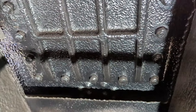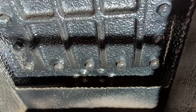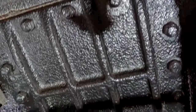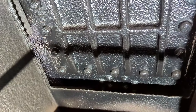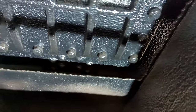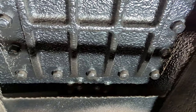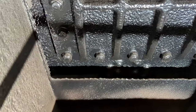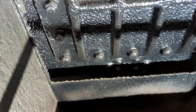So this is what the plate looks like from underneath. My job today is to heat these bolts and try to take them out and drop this plate. I believe this is a cover plate, and it looks like there might be some gasket material we're going to have to deal with. I like to come in, get a game plan, and really look at what I'm working with — think of the smartest, easiest way to do this. I like what I'm seeing with the bolts and I'm going to go get the torch.